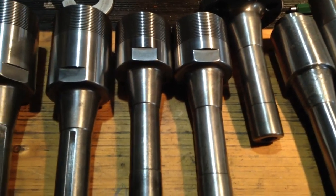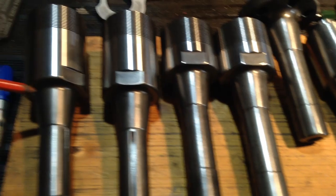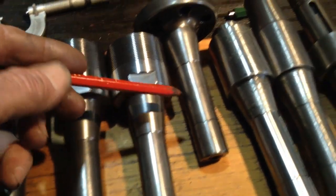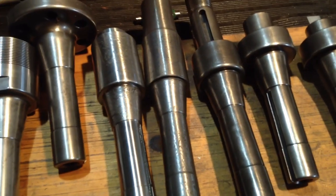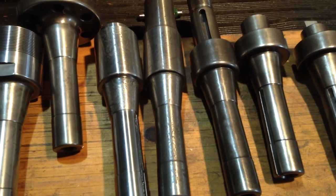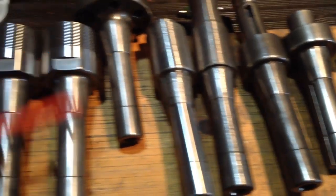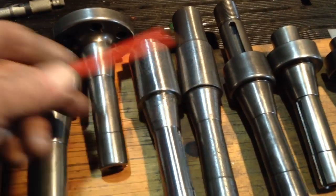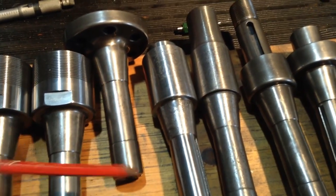Then what we'll do - we'll alter the angle of the wheel and then we'll be grinding from the compound, and we'll just rough grind in all of the tapered R8 features on them all. So after that's all done, we switch over to our finishing wheel, and we'll go through every diameter and finish grind everything - tapers and the parallel sections.